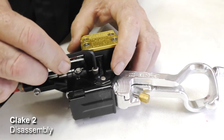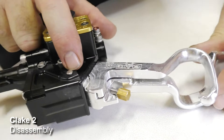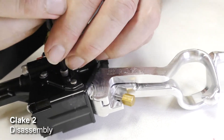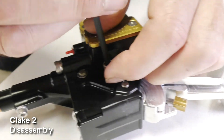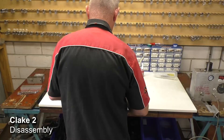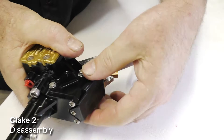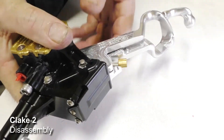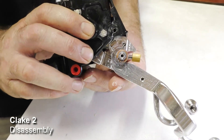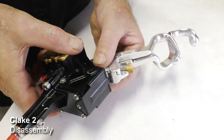We'll start with the Clake 2 and remove the shear pin. This is very important because you can't fold the lever out - it hits the shear pin - so don't try to remove it without removing the shear pin first, or you could break it off. With the shear pin removed, we're able to fold the levers out, and note that folds the top plastic cover off, which holds the central pin in. There is no E-clip underneath, so you simply push that up and the whole lever set will come out.